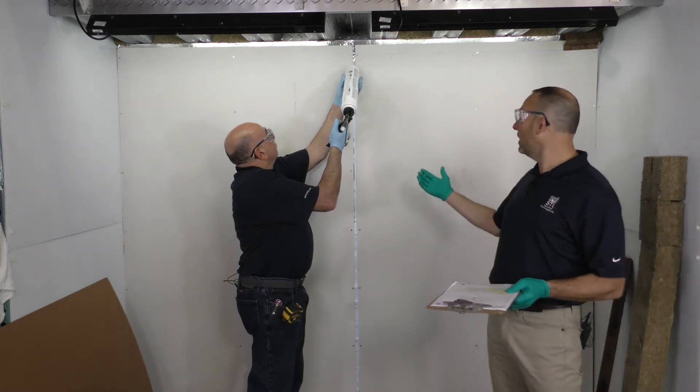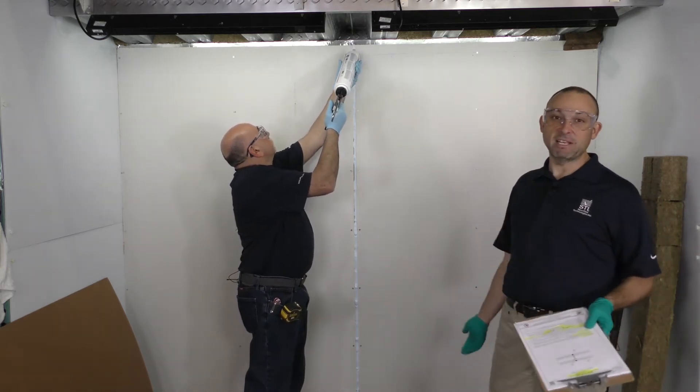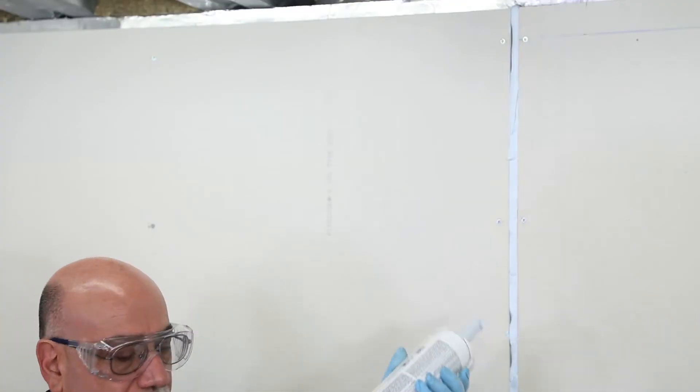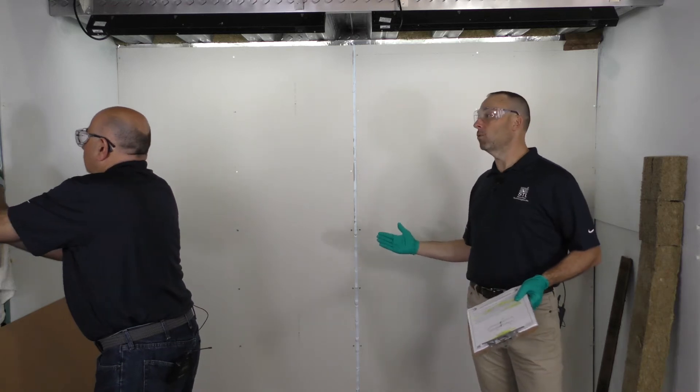It's important to note that in your one-hour wall, you're going to need to have a depth of sealant equal to the gypsum wallboard — five-eighths of an inch. Eddie, you putting five-eighths in there? I'm putting five-eighths in. So he's putting five-eighths in our one-hour wall.